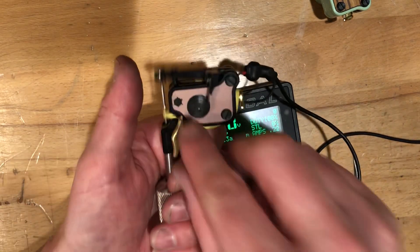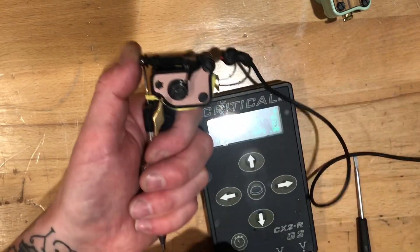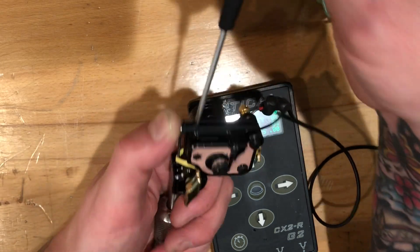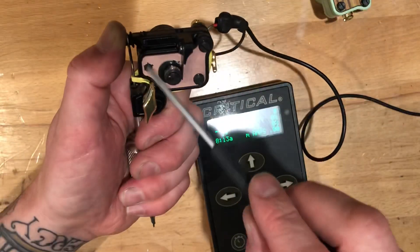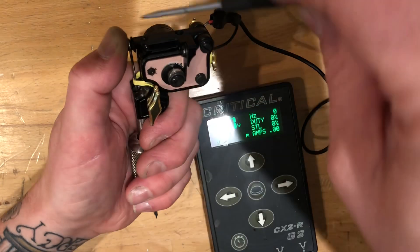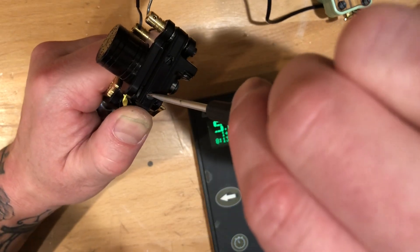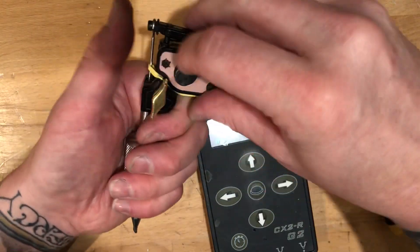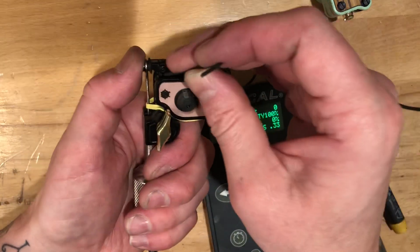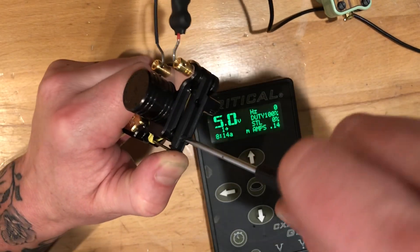Say I just want a longer stroke — I would turn it over to there. I'm going to loosen up the side locking screw and turn in the impact screw. Turning this to the right gives it less impact, but then I'm going to reset the impact with this screw here. For every notch you pretty much turn this a half turn — so a half turn is probably going to be about perfect impact. It was a little much, so let's back that off a quarter turn.